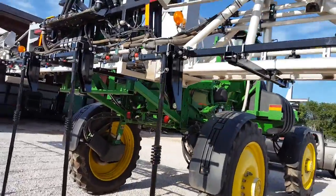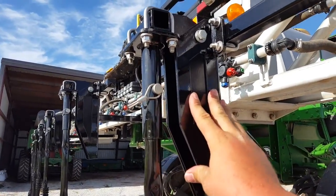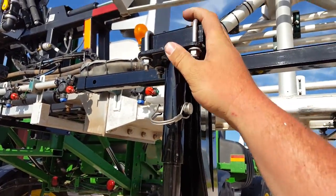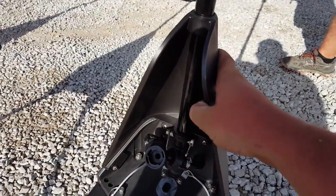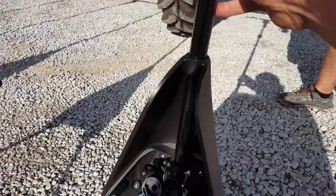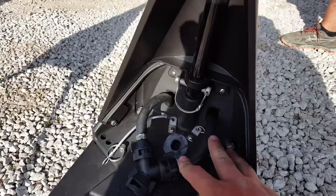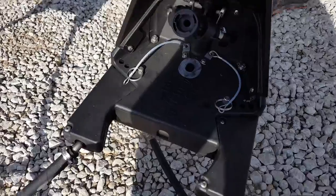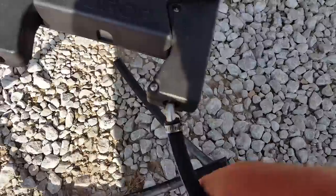After you put the sprayer mount assembly on, come in and install the breakaways. Put the breakaways on, tighten them up, put these on that are for the riser mount assemblies, and on the bases, put your shield on last. You want to run your riser tube into your shield, hook it in with the quick clip, and then install the screws. If you don't do that, you'll be taking them back out. Put your orifices in, and then lastly, put your YDROP hoses on and make sure they are curled out.